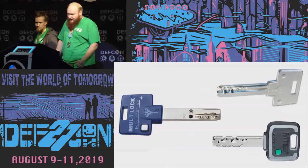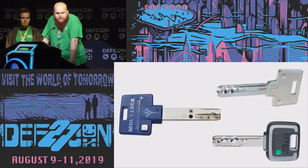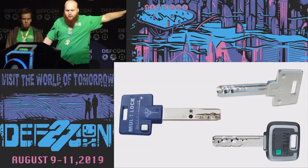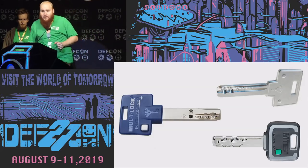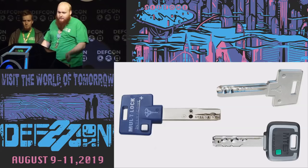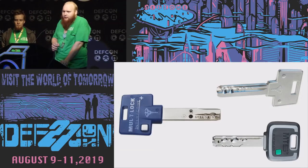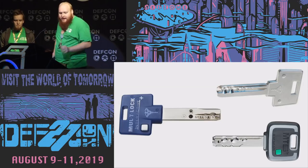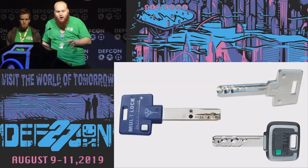All right, let's talk about multi-lock. So we see here the three generations of multi-lock key, classic at the top. And multi-lock is what's known as a dimple key, so the cuts are made on the side of the key rather than the top. Otherwise, the operation is exactly the same, setting pins to the right height, as well as it has what's called telescoping pins. So you have an outer pin and an inner pin inside of it. Other than that, it is a standard pin tumbler lock.